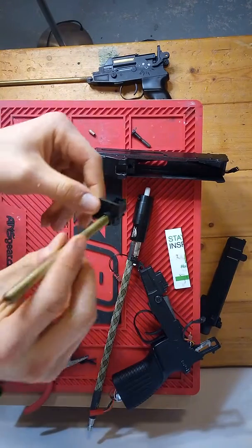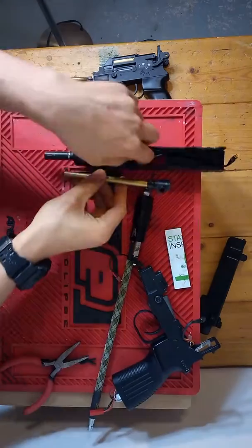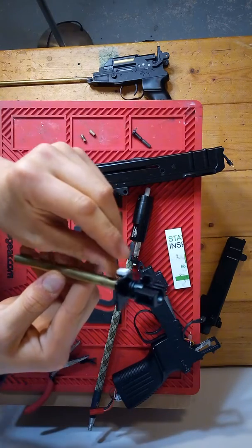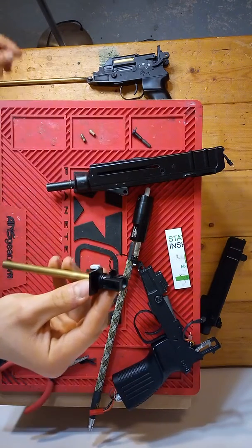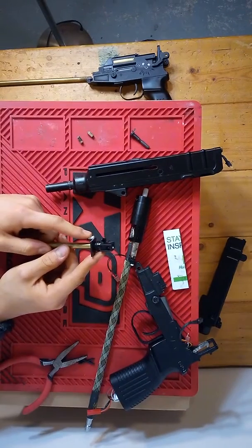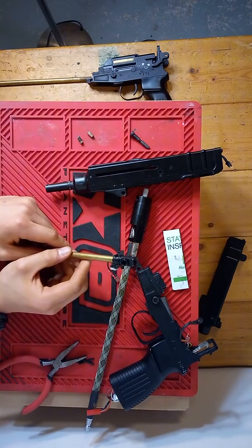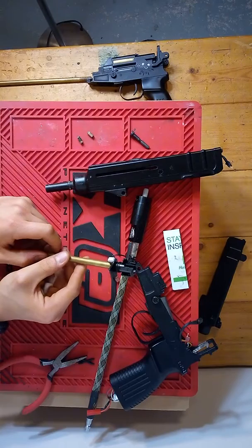There's a little plate on the hop-up meant to stabilize it inside the receiver and against the front of the gun. I've cut more pieces of hotel key card and glued them onto the arm to shim it more, trying to pressure the hop-up to the correct spot to stop it hooking right. It's helping — it's usable indoors with .30s and up. For .25s I'll definitely need to shim more. Range is about 130 feet before it becomes inaccurate, BBs travel about 200 feet, and I'm getting 310 FPS with .32s, but it's not accurate enough yet.